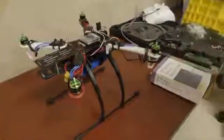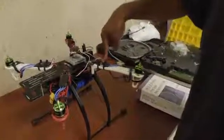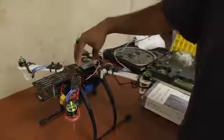This right here is a project I'm sort of working on still. It's a quadcopter, or a defunct quadcopter. It's got 4 motors, 4 actuators, 4 ESCs, electronic speed controllers. These control the speed of the motors. This is the main flight controller for it. So this flight controller sends data to these ESCs to indicate what speed the motor should go at. This is the battery right here. This is maybe half the weight of the whole device.